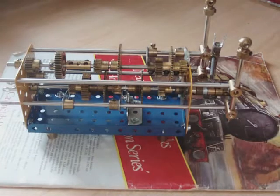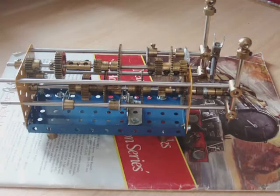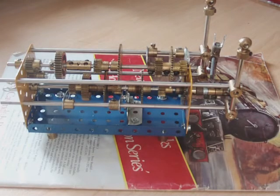The only other thing I'd say about this is that this key rod here and this coupling to a normal rod is a bit over-enthusiastic. It doesn't turn very well because the rod has some slight — it's not quite true. I think really putting everything on two rods like this is a bit much, and it would be better to have the whole thing on three rods just to make it a bit freer running.